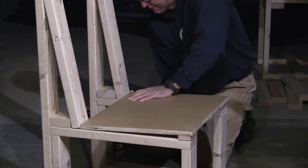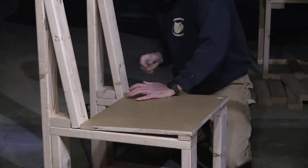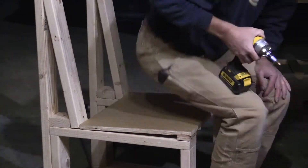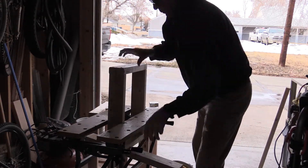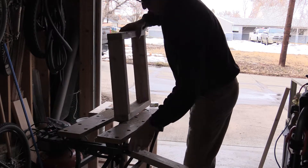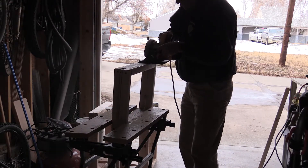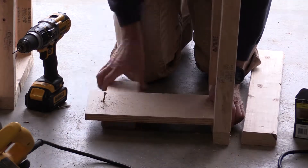I took a little piece of three-quarter-inch plywood and can slide it back and forth to adjust the angle. It turns out that having it all the way in at three-quarters inch is probably the maximum height I'd want. I'll either go flat or just up about a half inch to three-quarters of an inch. Next up is the propane box and the toilet cabinet. Starting to run out of scrap 2x4s, I had the idea of putting pieces together and then slicing it in half with a circular saw to form the two sides — it was a little sketchy and I don't recommend doing it this way.